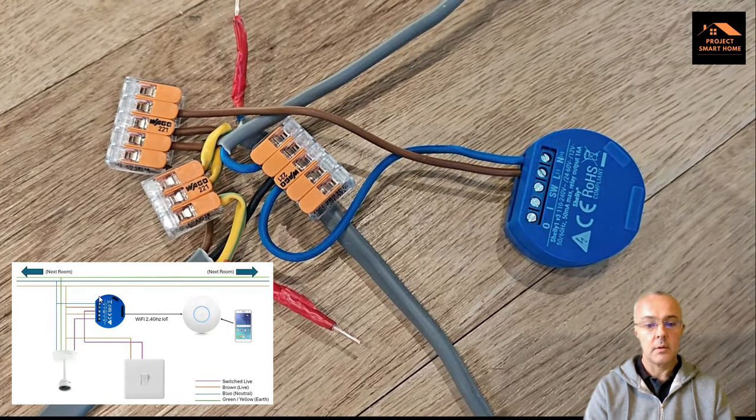In current wiring you'll have a brown and a blue wire going down to the switch. The brown wire is the permanent live. You would use the blue wire in that cable and put some tape or colouring around it so you know it's become a live wire, not a neutral, because blue is traditionally associated with neutral. This is the switched wire coming from the light switch up into the Shelly device itself. Terminal one on the relay is also a permanent live for the relay to operate the light, so we provide a brown cable from terminal one into the WAGO live connector block.